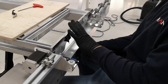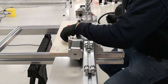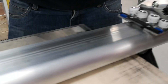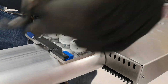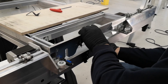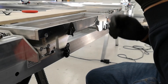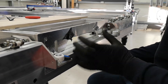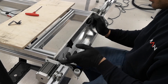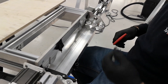Bring the beam out completely, as we've set our squareness. Now fully lock the first set of wheels in this position — hold down and lock. Check the preload again — it goes in nicely. Check squareness again — that has not changed, though it might change if you move the cam. With the motors locked in position, pull the beam back until the pinions are right on the edge; that will hold the beam in place. This is the easiest way I've found doing it.